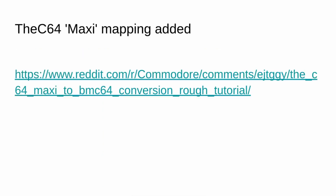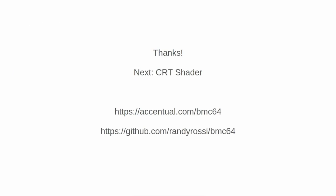And finally, there was a Reddit post and YouTube video posted by a user named OD81, who showed how to mod the C64 Maxi machine to house a Raspberry Pi and use BMC64 instead. So I made some modifications to BMC64 to properly allow an arbitrary Commodore key and control key definition — you couldn't actually change those keys before. I included that mapping with BMC64, so if you're interested in performing that mod, you can select the mapping in the menu. The next video I'll get into CRT shader work I've been doing to bring the same CRT emulation shader from RetroPie into BMC64. Thanks for watching.